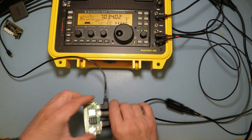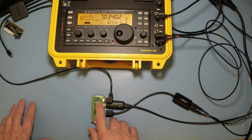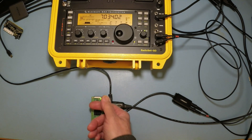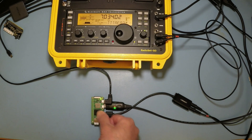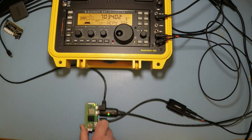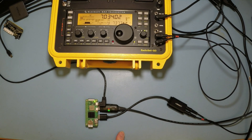By the way, I've been running the Raspberry Pi Zero 2W for probably more than 24 hours now, running WSJTX. And I'm also running the thing with FL Digi, because one of my colleagues reported that FL Digi was causing the Pi to rise to excessive temperatures. And I've not found that — the maximum temperature I've got up to was 53 degrees centigrade. At no time did the Pi look to switch off or throttle back or anything like that. I've got a small heatsink on the Pi, just a tiny little black one. It doesn't even cover the full dimensions of the Pi — it's just one I happen to have in the drawer. And that's kind of keeping everything under control.